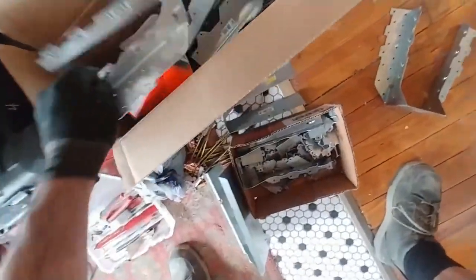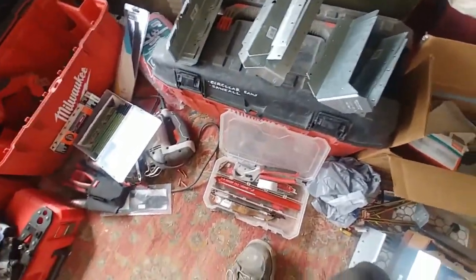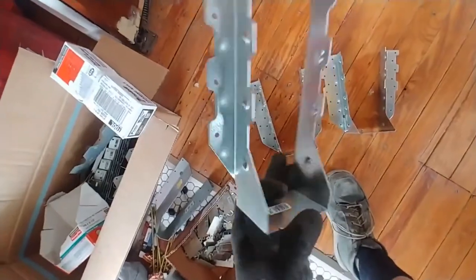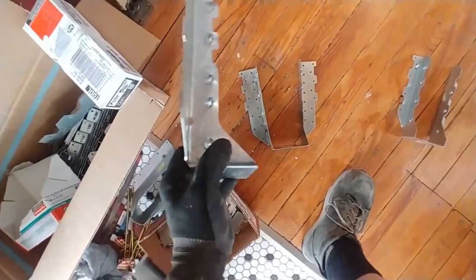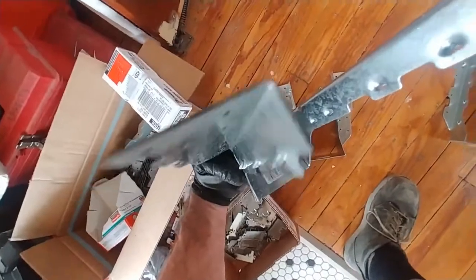Where's he? These are the acute angles for regular floor joists. A pair of heavy double hangers that I got, thinking along those lines. I don't know where the other double is, oh, here he is. So here's a conventional double joist hanger for 1.5 thick lumber, right? And then there's a hanger for a pair of LVL, and it's thicker steel than this stuff here,